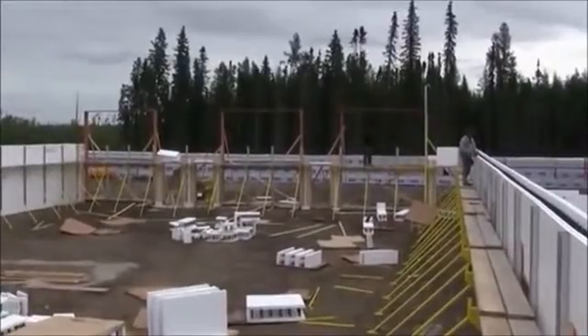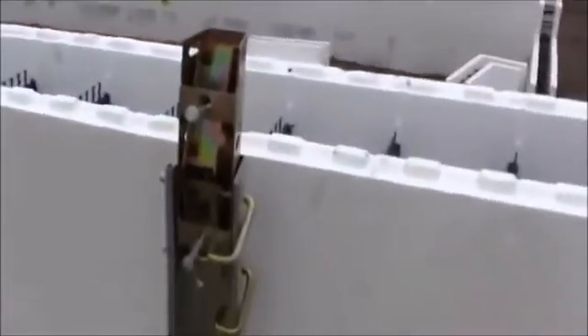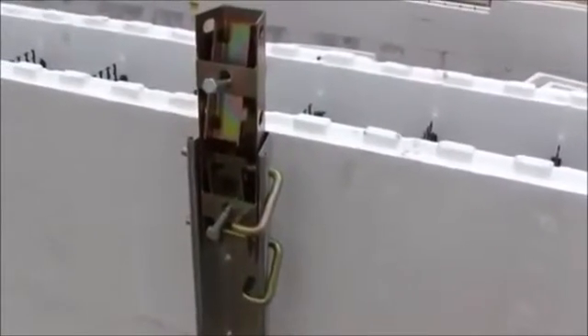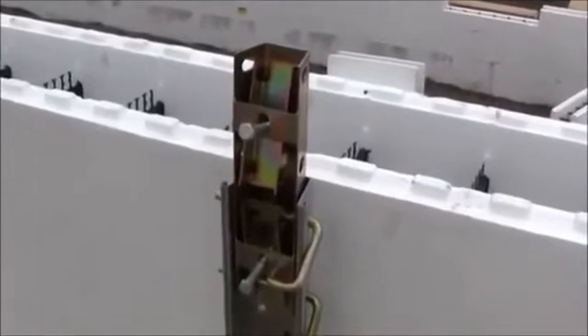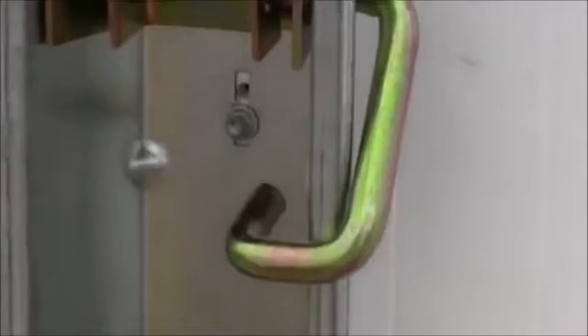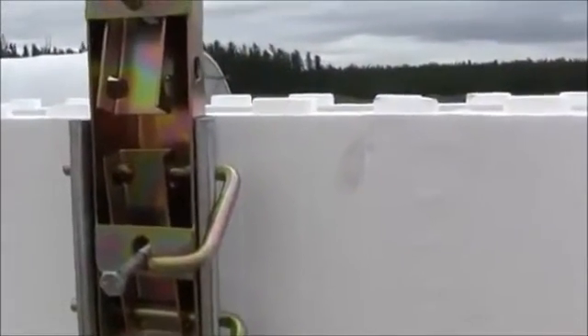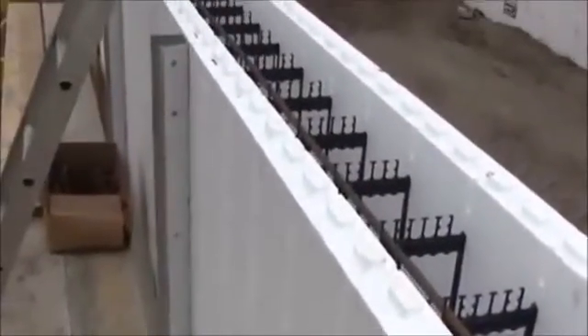If I come back over here you can see the openings — we're going to be 2 foot above that, the big openings, 18 foot high above grade. With these scaffold, we have this bracket that's clipped on with 2 gravity pins, and those 3-quarter-inch bolts just get tightened up and suck everything together, making it all aligned so it becomes one pole — that way we can go up to 20 foot high. One thing we found: because we're using the hex-headed sheet metal screws, we need to put those in 8 inches down from the top of the wall. That allows this to go in place without any interference — otherwise the screw head interfered on the back side of it. So you just have to be down 8 inches and think ahead on that one.